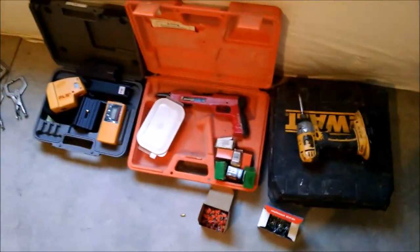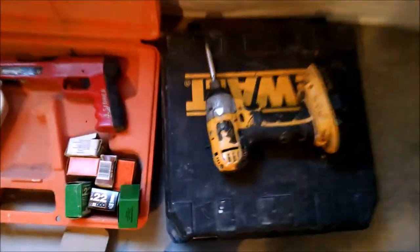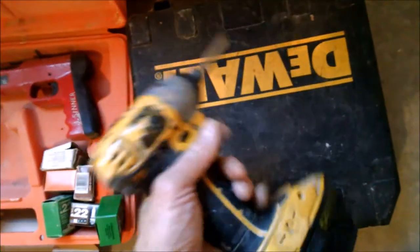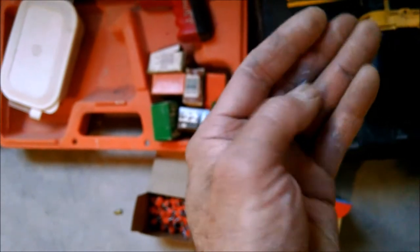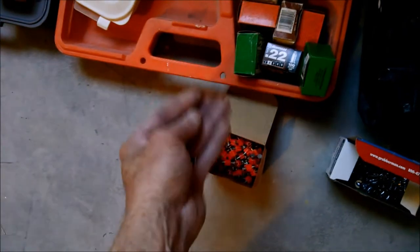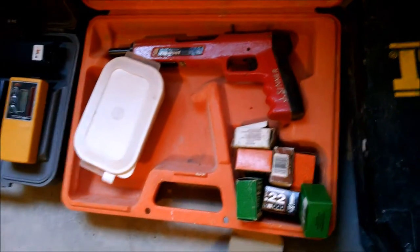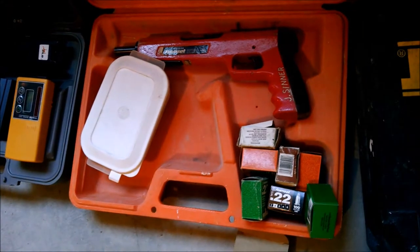Here are your basic tools you need to frame a basement in metal studs. I used to be a journeyman carpenter for 15 years in metal stud framing — I framed ceilings, soffits, and miles and miles of walls. Good cordless drill to put screws in. I'm using tappers — what we call panhead tappers. Your pins to nail your track to the floor, three-quarter inch. I have a single-shot ram set — illegal on big jobs now, but still good for residential.